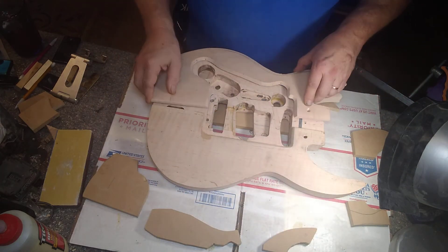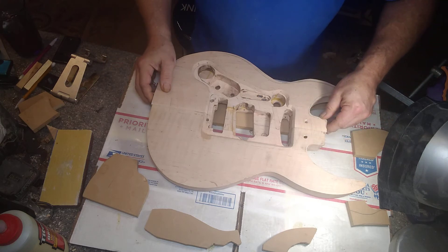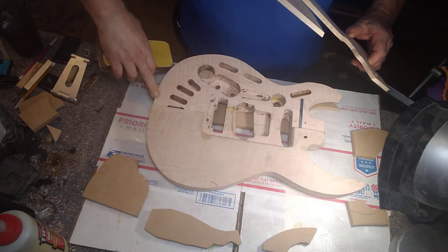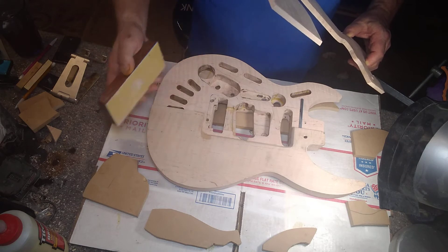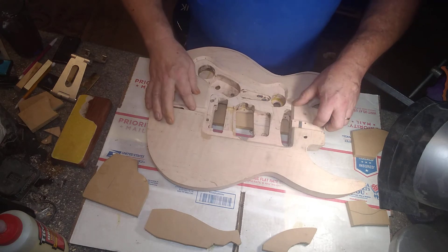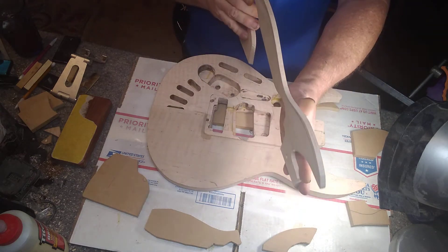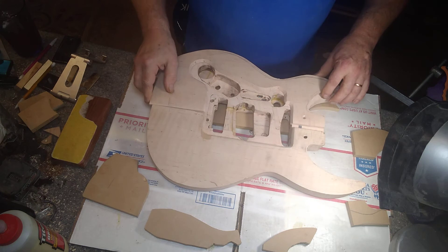I have this prepared to go on. Before I go to glue this on, I'll spend actually even hours flat blocking it with a block like this, getting especially all the edges nice and flat. You can really tell when you're using a flat hard block where you need to sand more and where you don't. I'll take this edge to my table saw with sticky sandpaper down, run my fence right next to it, and sand it back and forth to make a perfect 90-degree flat edge.